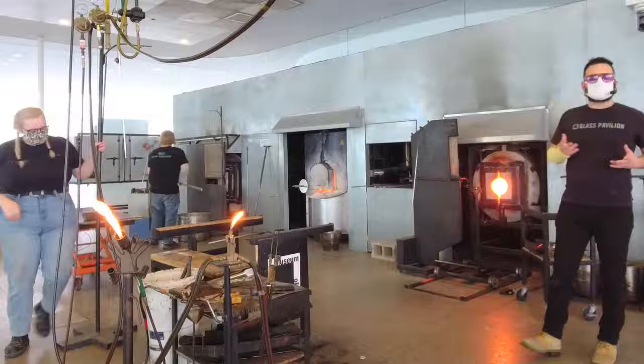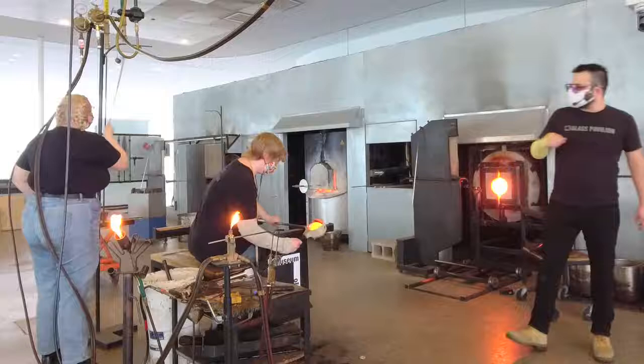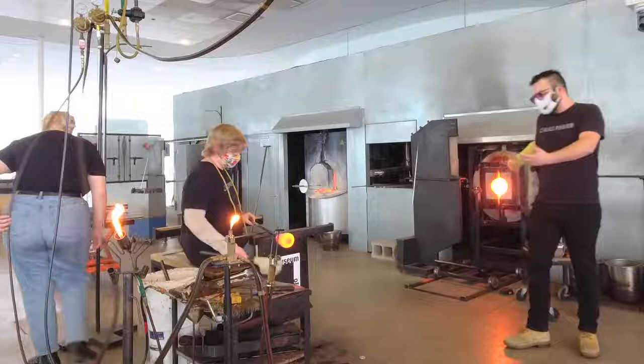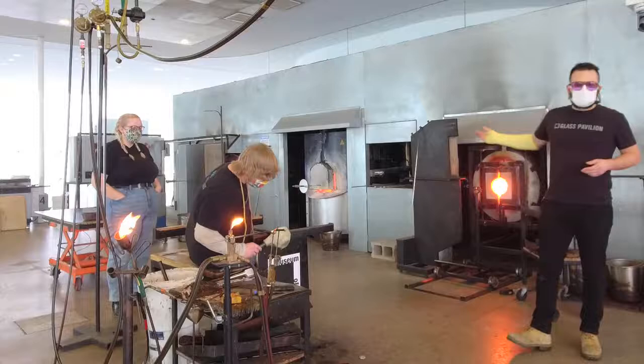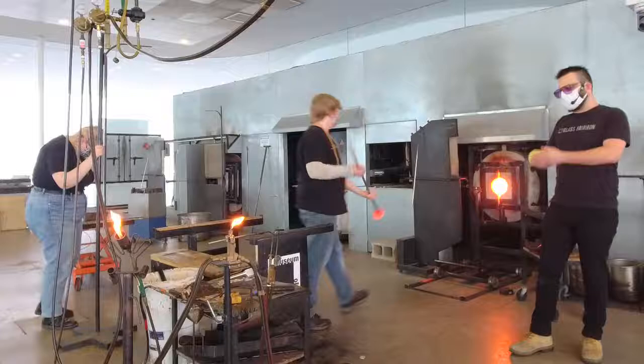Unlike that fly, Colin has got a huge gather of glass now that he can really start working with. He's rocking right now at probably somewhere about five pounds. And as he holds the pipe farther and farther back, that can increase how much the weight actually is. Anytime we gather, we're effectively doubling the weight. Sometimes it can be as heavy as about two pounds — one kilogram — then we go in and gather and it turns into four pounds, two kilograms. It's just a very good rule of thumb to always think that every time we gather, we double it in weight. That's why we also have another form of gathering called a strip gather, where we drip some of the excess glass off just to control it a little bit better.